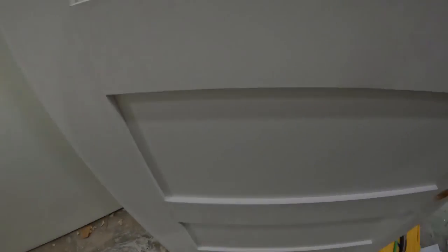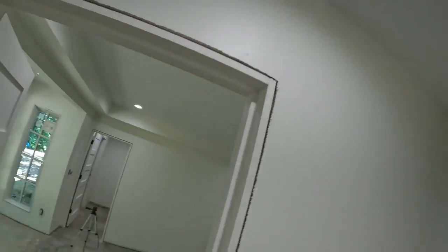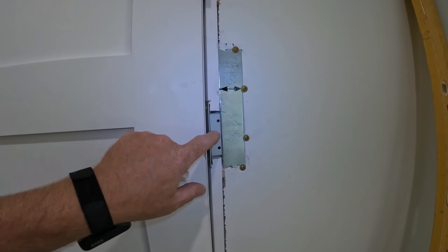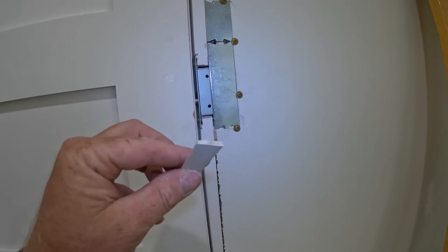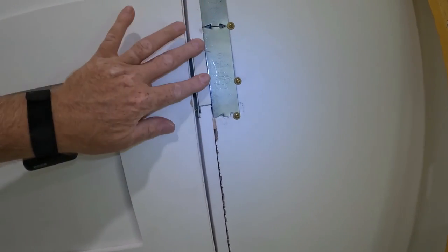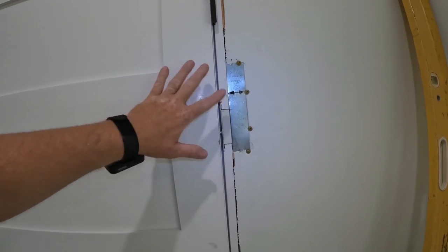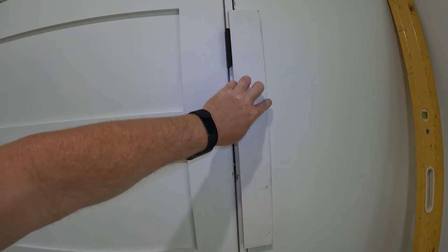Got it — beautiful. Right here, this bracket is just a little too wide for this door. Maybe I should have looked a little harder before I bought one, but I just took a piece of jamb trim and I'll go ahead and piece that in there. We'll get that glued in and dried, do a little spackling, get it nice where it looks all one piece, then come back with our casing and trim right over the top of it. It will look just fine.